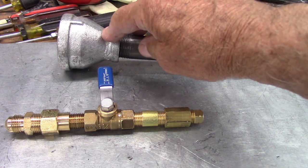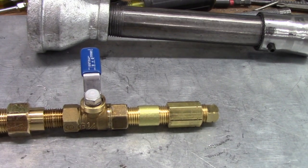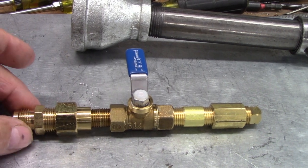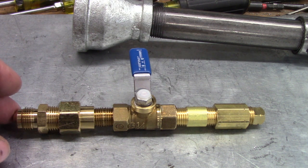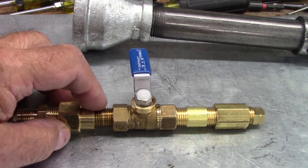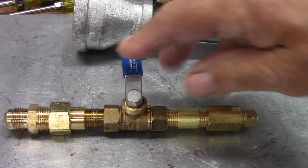This is an inch and a half to three-quarter. Now we're down to this portion here. So what we've got here is we've got a three-eighths fitting here. It's a compression fitting that will go to the gas valve or the regulator. Then it goes three-eighths to quarter-inch nipple, quarter-inch valve, another quarter-inch nipple, quarter-inch coupling. And then on the end here is a three-quarter cap.